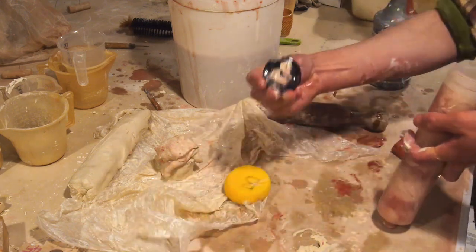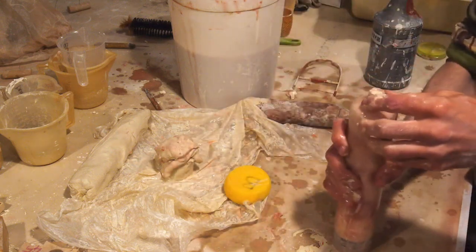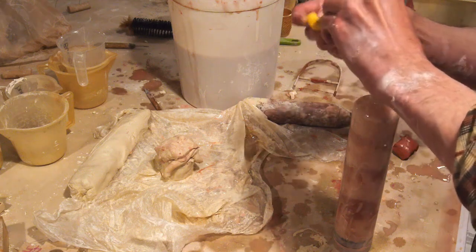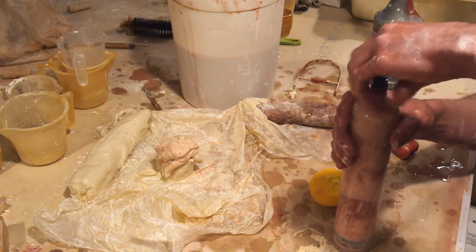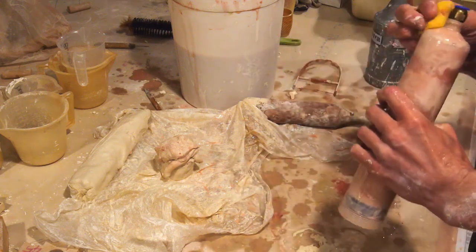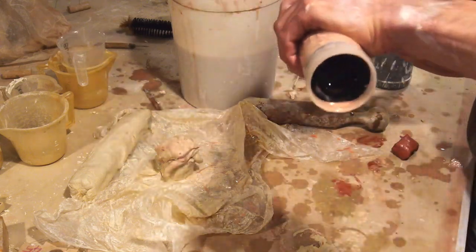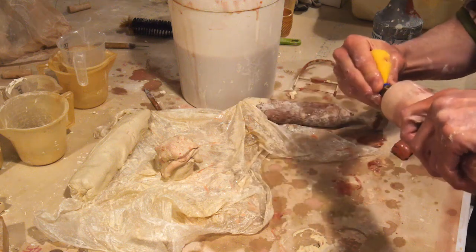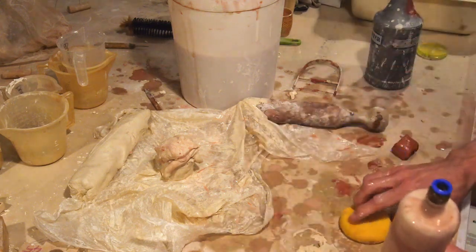I got the back end piece and I'm pushing that in. I keep all those little bits soaked in water all the time when I'm printing — the nozzle parts and the little back end part I just keep in a bucket of water. I find it's really important to make sure the quick release fitting is well cleaned out. I'll use a toothbrush to get all the little bits of clay out of there and a sponge, making sure it's clicking easily and springing back so it gets a good connection to the hose. When I'm not printing I make sure it's really clean before it all dries out, because if clay dries in those little parts it's really hard to get out.